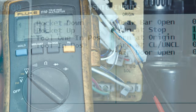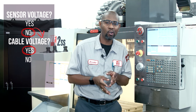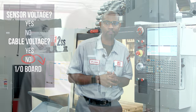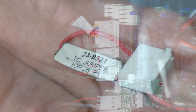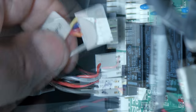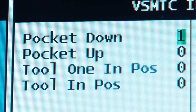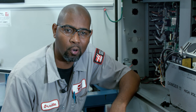We just saw voltage at the sensor and watched it change as we activated the sensor. If there's no voltage at the sensor, we need to move on to the cable side of the connector. If there's voltage at the cable's connector, then you know the cable is good and the connector or sensor may be bad. If there's no voltage, move on to the I/O board. Locate the cable connector for the proximity sensor cable you're testing. To test the sensor output at the I/O board, you'll need a jumper for the cable connector you're testing — in this case, we're testing the pocket down sensor at location P3 using the tool changer jumper part number 33-8521. Check the diagnostic screen. If the bit changes when the jumper is installed, you know the I/O board is fine and your connecting cable is probably bad. If the bit doesn't change, then you need to call your HFO and have them come and check your I/O board for possible issues.